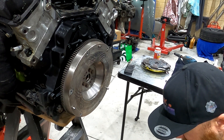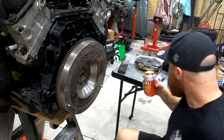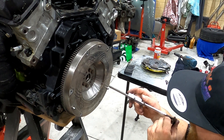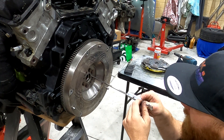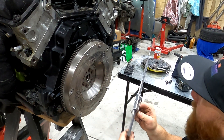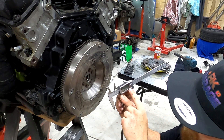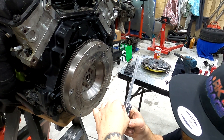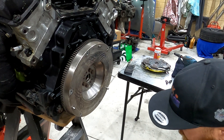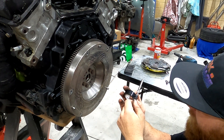This is a step I like to do with my vernier calipers. You always turn it on, zero it, then find out how deep the dowel is. That's 30.76 mil, or 1.2 inches. Let's just do it on another one to verify — 30.3, basically 1.2. So I lock this in so it can't move. Then I get my drill bit, line it up, and tape it so I know to drill up to the tape.